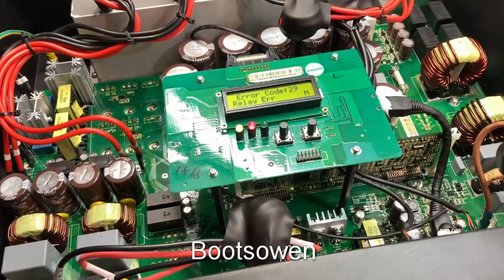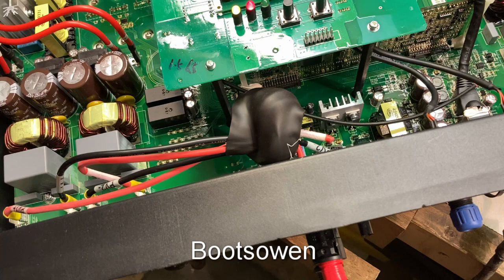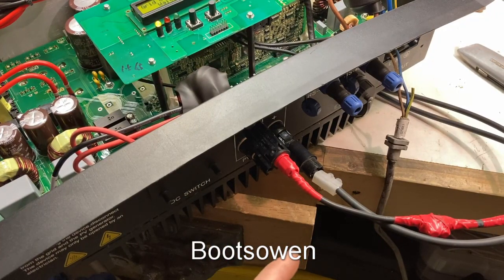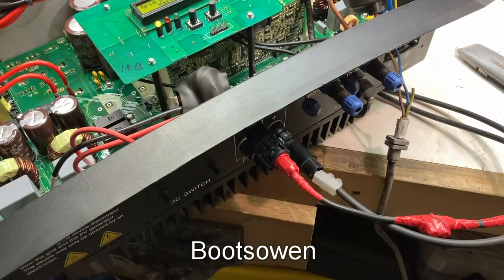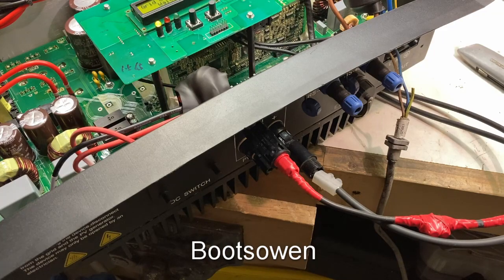The only thing I could do — one of the inputs has been caught there, that red one. I think that's PV2 and the plug was just damaged. It's currently on PV1 — I could try putting it on PV2. Because I was missing a plug for the PV2 input, I've just pulled the PV1 input off and put it over there. The other thing I did as part of my test rig was to cut the clips off the solar connectors — where there are little tabs that clip on, I've just cut them off with a Stanley knife so I can just plug it in and out without it having to stay put. Likewise for the female components — I've chopped off the bit that clips on so I can just slide those plugs on and off. That's the bit I always find a bit tricky when testing these things.